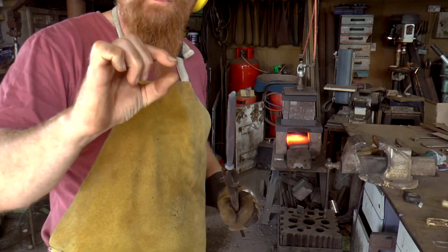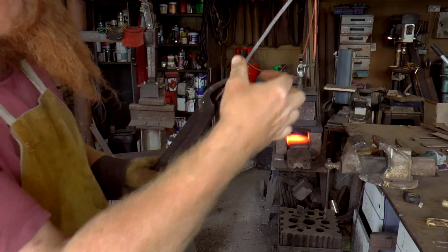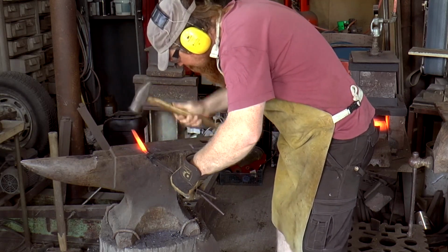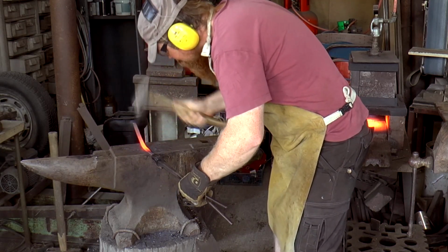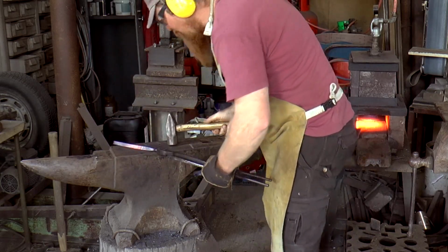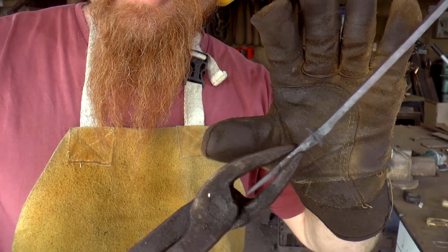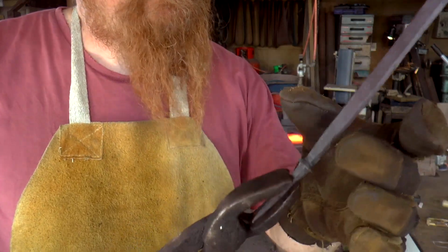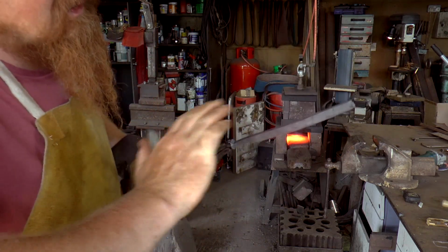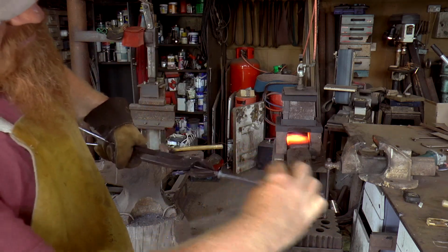That's very close, it's about that far off the length we need. There's loads of thickness down here, so I'll thin that out a bit and we'll get there actually. There we go, by filling out this last little bit here, I've now gained enough material, we are at length, so that's great. Next up, I'm going to heat it up again and then just tidy it up as it is, make it nice and consistent, so we've got a consistent width this way and that way.